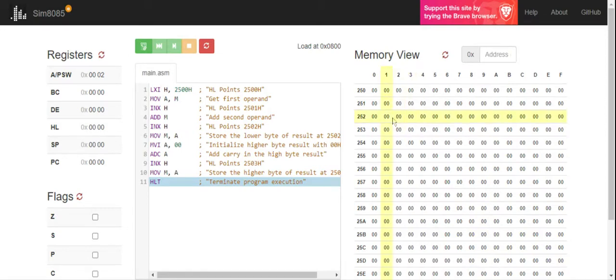You may be aware that there are 2 power 16 combinations of memory locations available in 8085, coming to 65,536 locations. Those memory locations can be seen by this particular combination 0000 up to FFFF. There are 2 power 16 combinations of memory locations available, and you can use any of these memory locations to get your particular data.